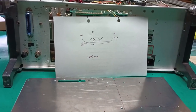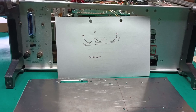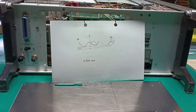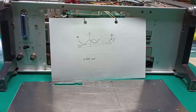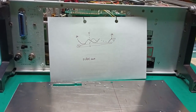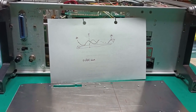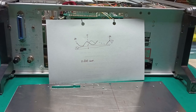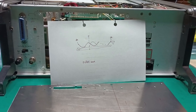It's very important. If you haven't seen my video on why SWR meters aren't... SWR is standing wave ratio, usually VSWR, voltage standing wave ratio. And a ratio is a quotient of two numbers. A ratio of 10 is the number 10 divided by the number 1. In radio, that ratio used to be using a light bulb and a loop of wire on open line transmission line to find where there are voltage minimums and maximums. And that was originally what VSWR was. With our modern SWR meters, we can't do that. They measure at a single point, so there's no ratio.